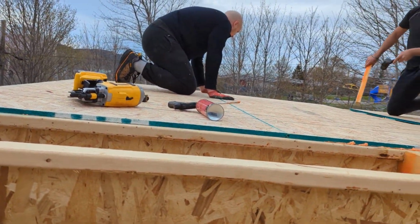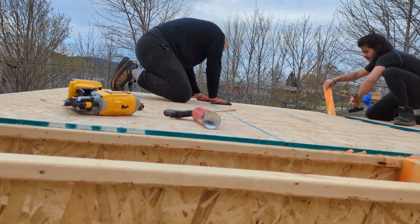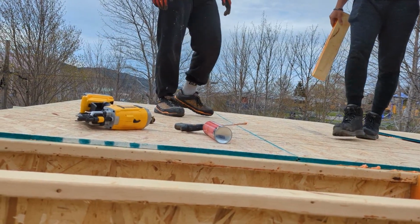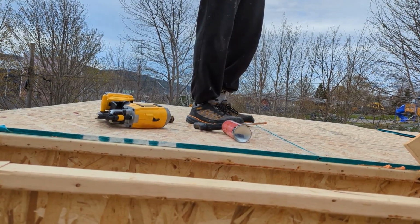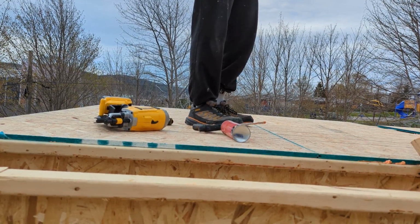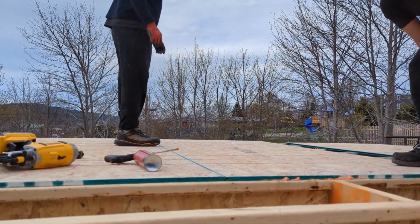All right, because it has to expand a bit, because it's going to swell up with the rain here, eh? Yeah. More. Okay. That's good. And then make sure, like, you didn't go. I think you went a little too far here. Go check. Too far is in too tight. No, on the edge. Push it that way? Yeah. Well, you take a look. You tell me. You're splitting eighths. There you go. Yeah, because you got to leave like an eighth of an inch. The stuff expands a bit, and you don't want it to swell up so much.